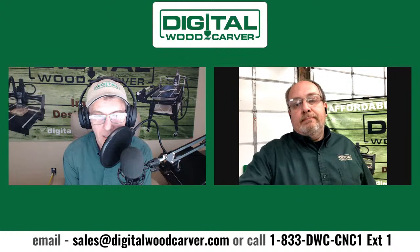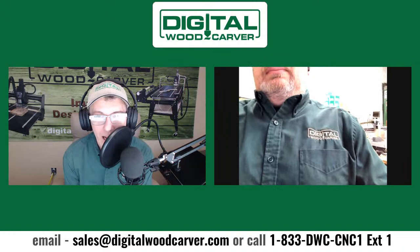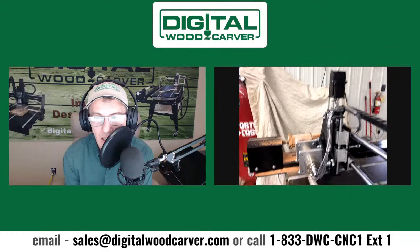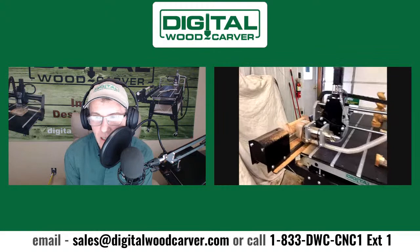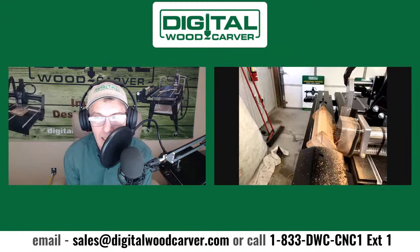Now, the fourth axis is unique for the Digital Wood Carver because it mounts to the side of the CNC, and the router actually pivots 90 degrees to cut over on the fourth axis. Burl's showing you the setup right now. You can see our spindle is pivoted 90 degrees to the table, and that way it can carve on the fourth axis. That is due to our unique swivel plate that the spindle is mounted to.